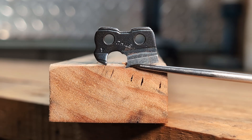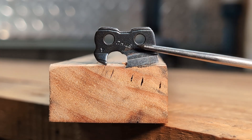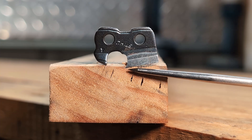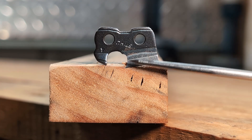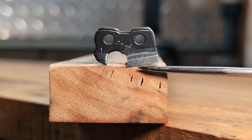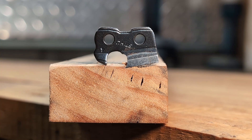The other thing to pay attention to while we're here on the side is how little of that side plate is actually engaged with the wood - it's only a very tiny section. This is a standard 404 cutter, so it has a 30-thou depth gauge setting. If you're running a standard 25-thou setting on a 3/8 chain, then there would be an even smaller amount in contact with the wood. We can also see in action the top plate clearance angle - you can see how the cutter is angled back to allow that clearance behind it, so there's a reduction in friction.